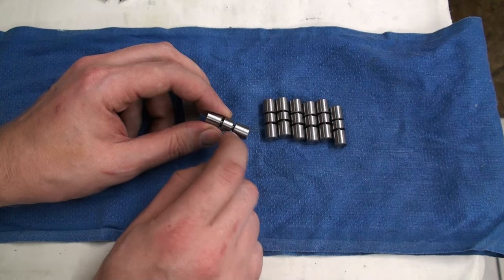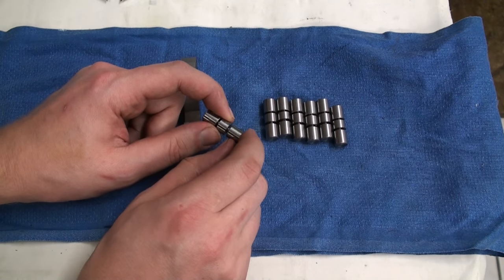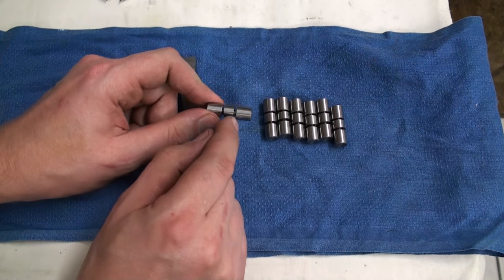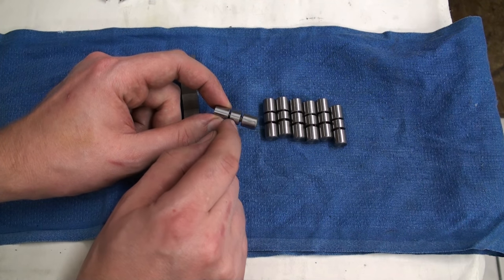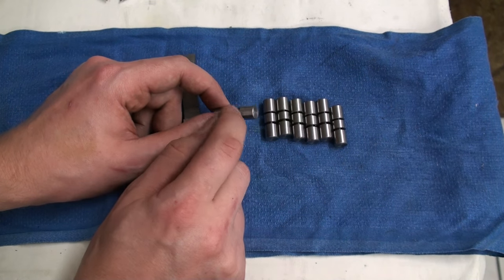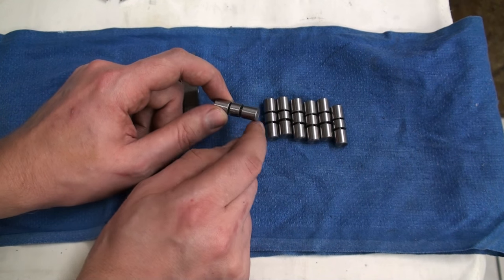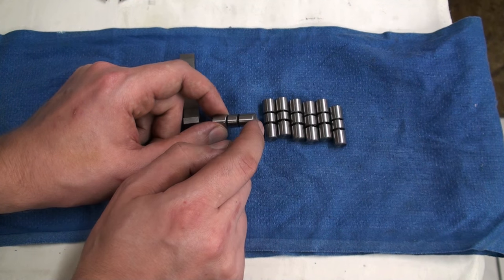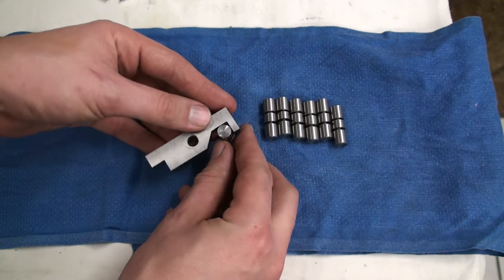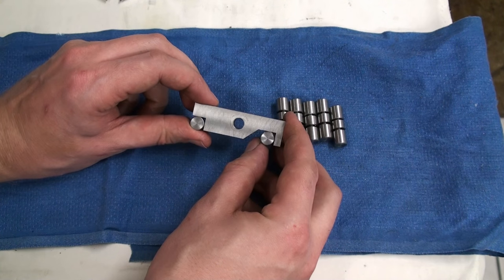Then I'm going to grind the outer diameter with the tool post grinder on the lathe so they are nice and round and true, and then we're going to cut the roller off from the remaining stock. Maybe we just break it off and clean up the broken surface, or we use a small cutoff disc, or we will see. And then we're done, then we can screw the roller into the sine bar like this and like this, and we're good to go.